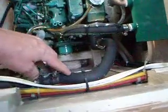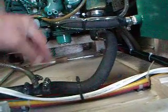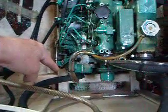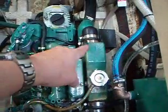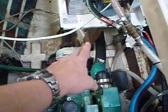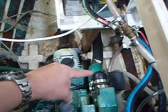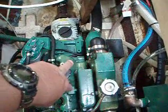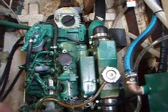So when the engine stopped running, the water ran down this hose here, and everything else was primed in the system — it just drew water up through the strainer, right through the hoses, into the impeller pump, up past the anti-siphon break, and back down again. It went through the heat exchanger and dropped into the exhaust, and obviously the exhaust is all uphill, so it filled up the exhaust until it overflowed the elbow. The water went back into the engine through two open exhaust valves, flooded the engine, hydro-locked it, and since it wasn't found right away, it seized the engine. That's it.